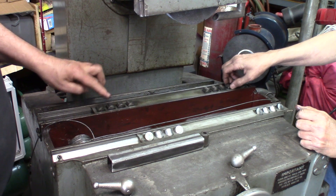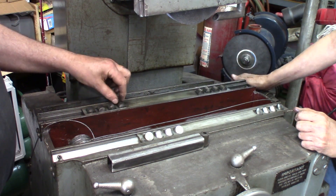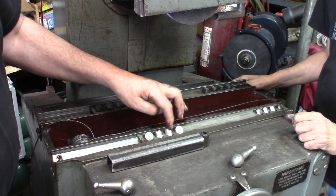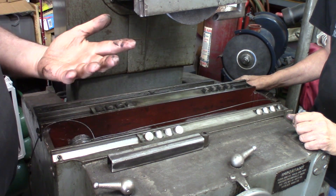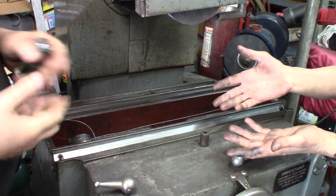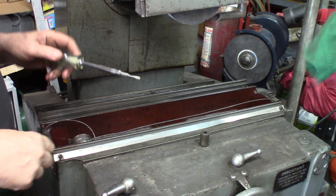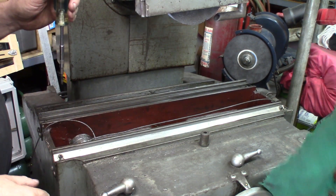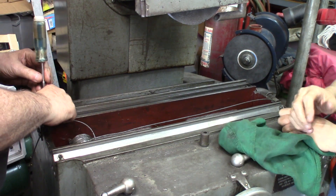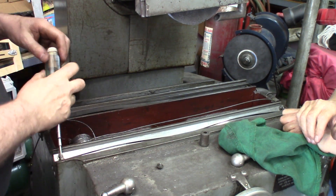These rollers — if they lack lubrication sometimes they might slide instead of roll, so there may be some damage there too. We'll check that out, and if some rollers aren't good we'll make or source replacements. This is going to be a disassembly video today. The wear bands are just held with screws on the end, all the same, so no worry about placement.